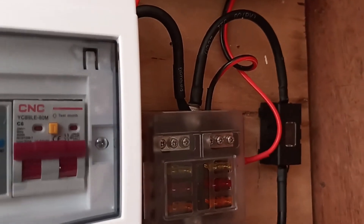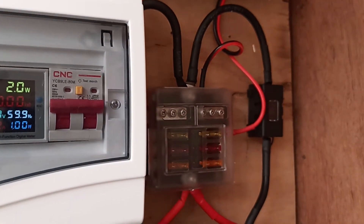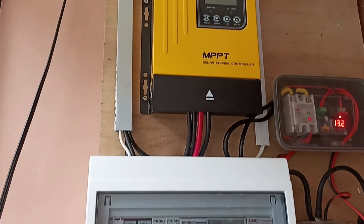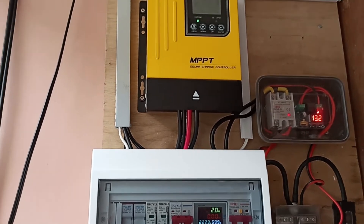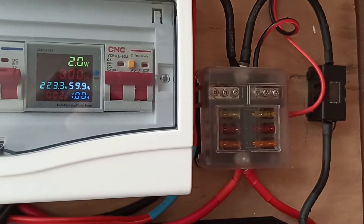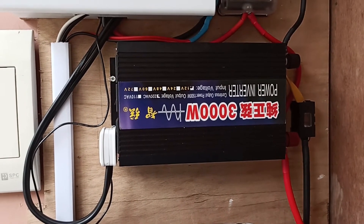Further on the right here, this is just a fuse to protect the wire — a 16 square millimeter wire with an 80-amp fuse. By the way, the wire from the solar modules all the way to the charger is 6 square millimeters. Then the wire going from the charger to the DC low voltage module is 10 square millimeters. Then from there to the inverter is 16 square millimeters, and from the inverter to the battery is 25 square millimeters.